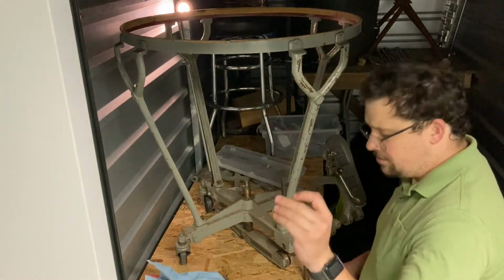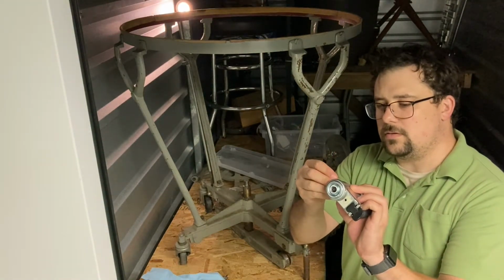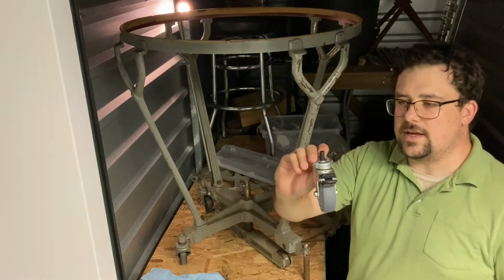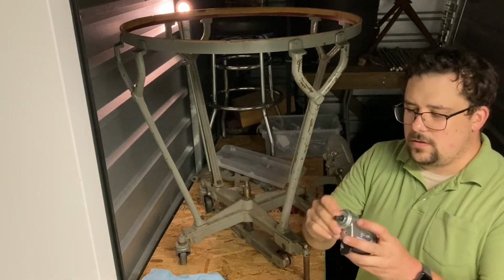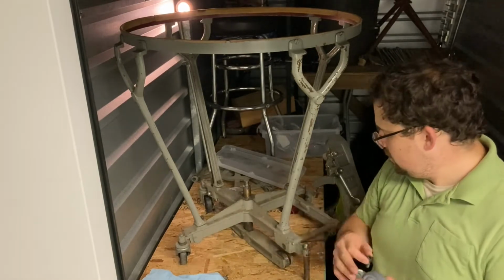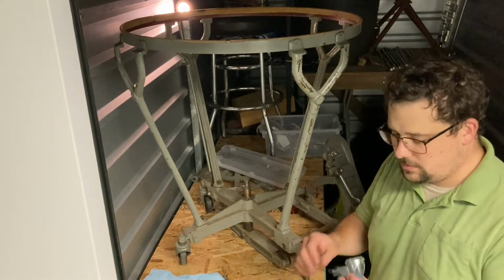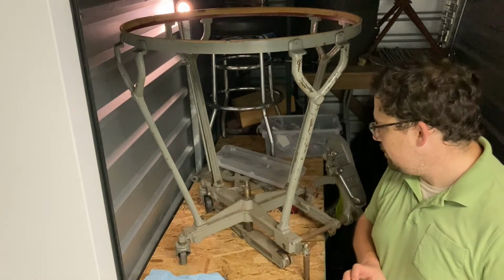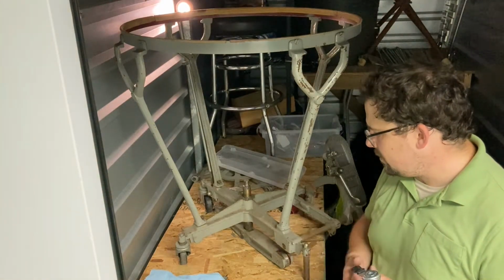This is a 3/8 inch bolt. It passes through what's called the kingpin. It goes like that, so you make your own stem. The thread on this probably needs to be repaired. Use like a helicoil for at least the two in the front, or rather the player side.